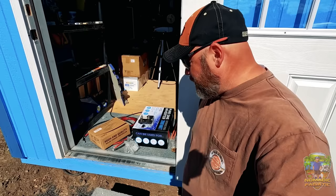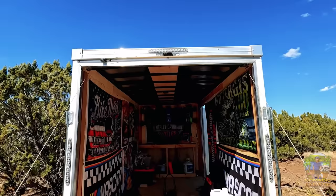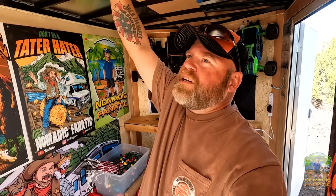First we got to start with the panels. I put the ladder away so I'll have to bring it back out, but I climbed up there last night to make sure I can fit three panels up here. What I'll be doing is measuring so I can hit these steel braces every 14 inches on the roof, so we get a really good solid connection and these panels will not fly off. I was going to mount the Z-brackets to the panels, then drill into the beams — but I decided let's go ahead and measure one more time.